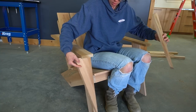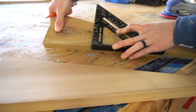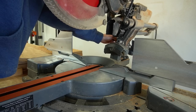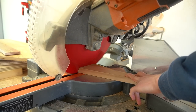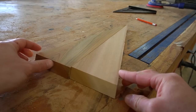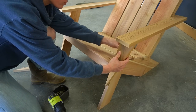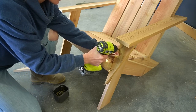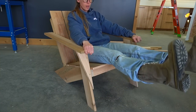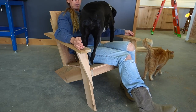Now I just have to add one more detail to complete the chair — those triangle off-cuts I saved from cutting the legs. I laid them on the workbench so the right angles were together at the top, then used a speed square along the straight side to find where the width of the triangle was about three and a half inches and marked it. I adjusted my bevel angle on the miter saw to 20 degrees and cut along this line so the square corner was toward the back, then cut the second triangle mirroring the bevel direction. These pieces fit right up under each armrest — they add a little extra detail and support, but they're totally optional. I screwed them into the front legs with one screw toward the top and one toward the bottom on each side, and that wrapped up the build.